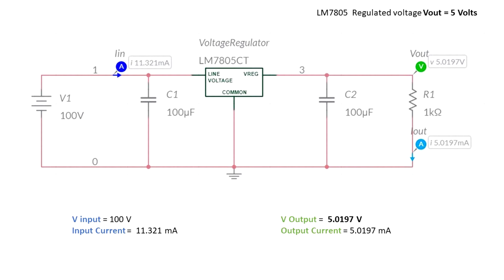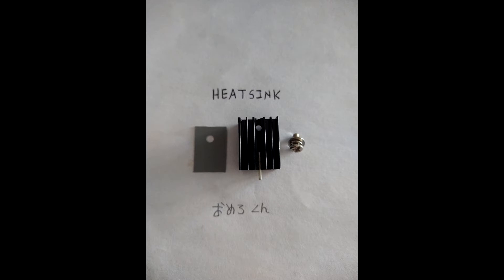Be careful because in real life, if the potential difference is very high with respect to the regulated output, the device is going to dissipate a lot of power and become very hot. You may need to install a heatsink to cool it down. Otherwise it could melt the breadboard or even catch fire. So be careful.